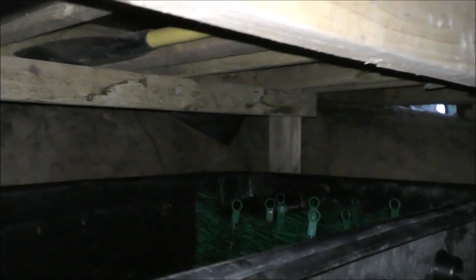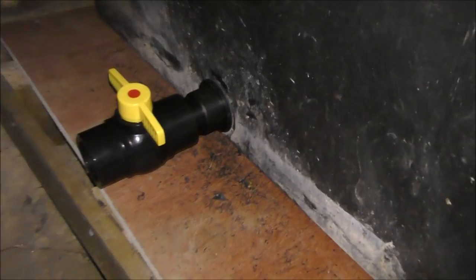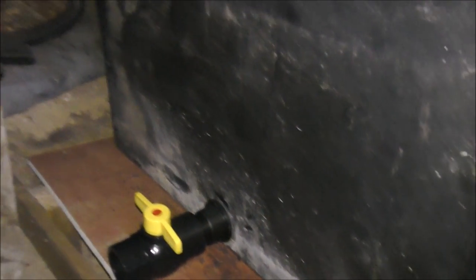Okay, so that's all our outlets on there. You can just see through to our inlet going in the back corner, and with a few brushes in and our false floor installed, all we need to do is fill that up with brushes. We'll fix some outlet pipes on here — just two-inch pipes with a straight bit, an elbow, and then a downcomer firing down into our moving bed. I've put a bottom drain on as well to enable us to drain all the muck easily out of the bottom. Okay guys, that's it for this episode — in the next episode we'll be concentrating on the moving bed part of this filter, so stay tuned. Thanks for watching — if you've enjoyed this video please share it wherever you want, and I'll see you next time.